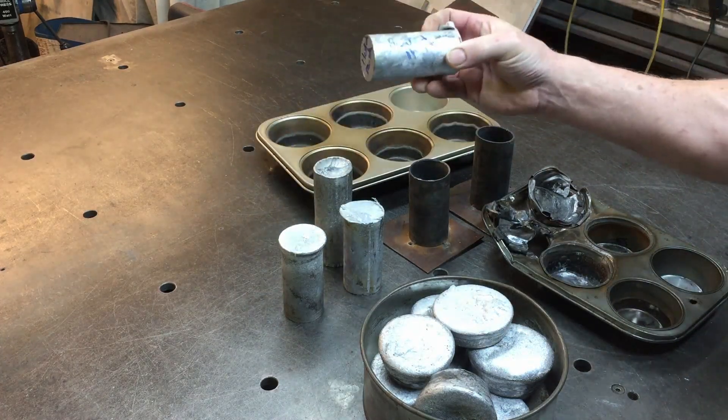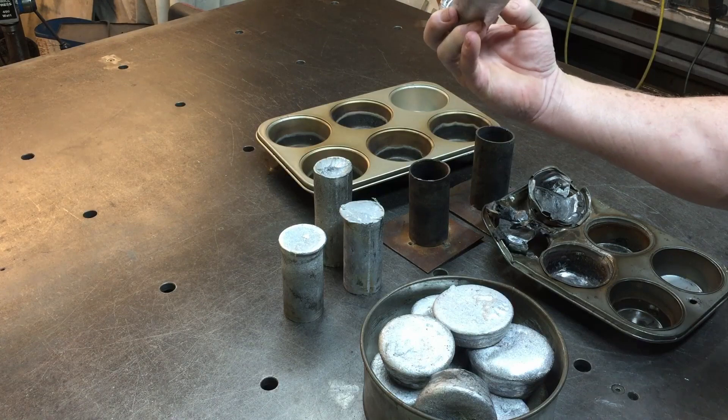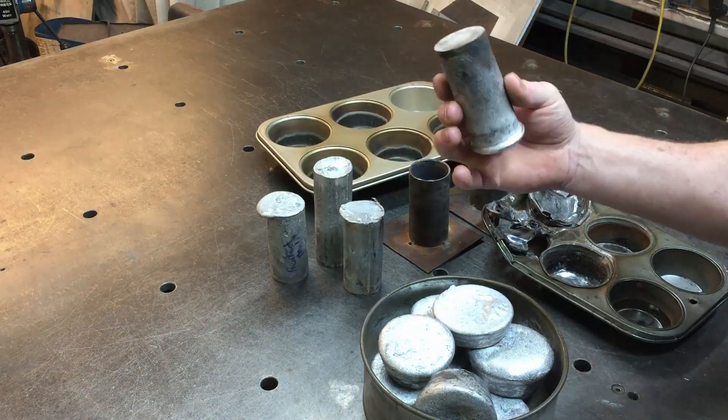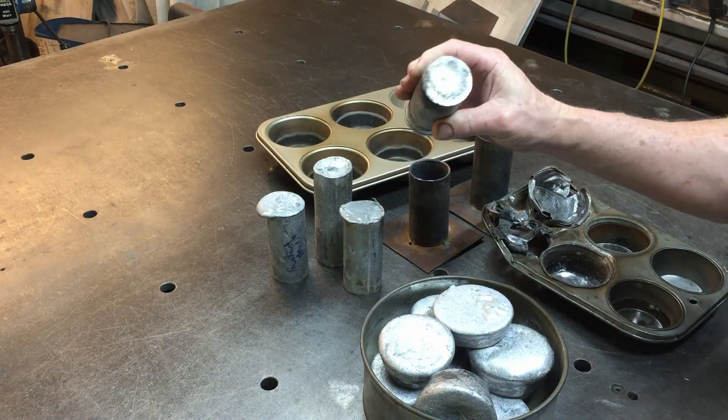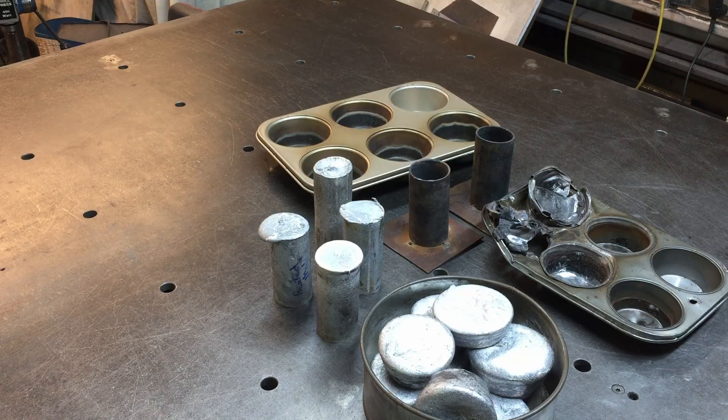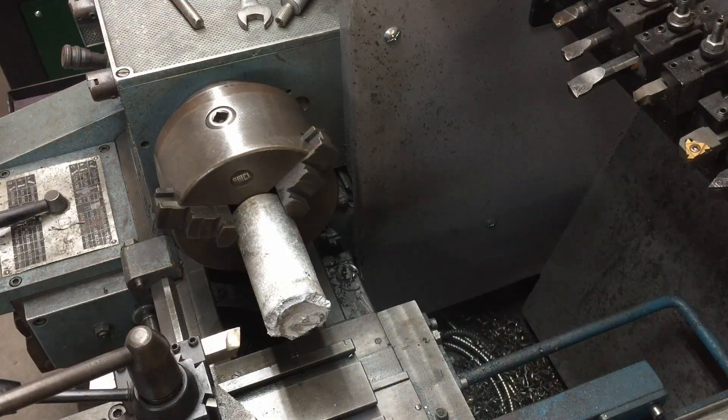I marked the one that I heated the mold up for, just to see if that's better quality - maybe the other ones might have some pits, holes, or air bubbles. I'll have to wait until I start turning them down to check. I've got one of the castings in the chuck and I'm going to turn it up, clean the end off, put a center in, and see how it comes up. This one is from the smaller mold.